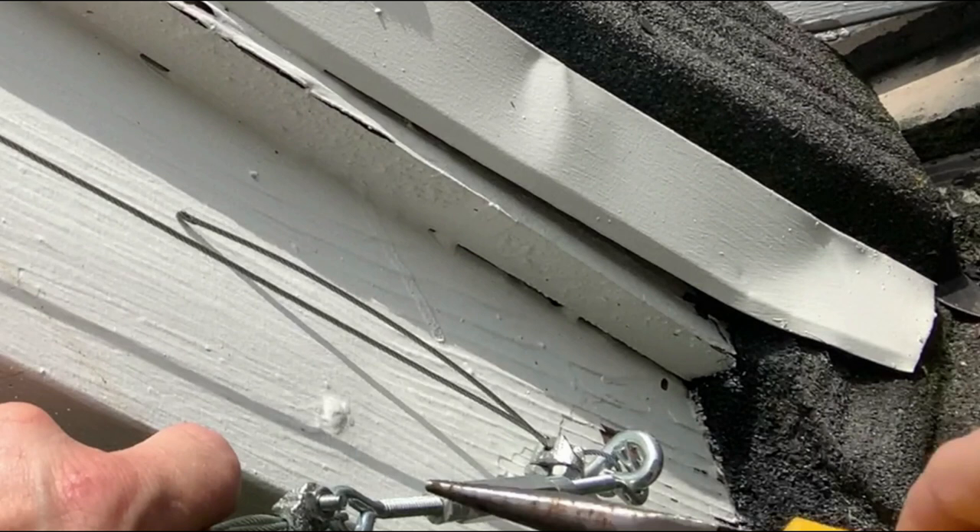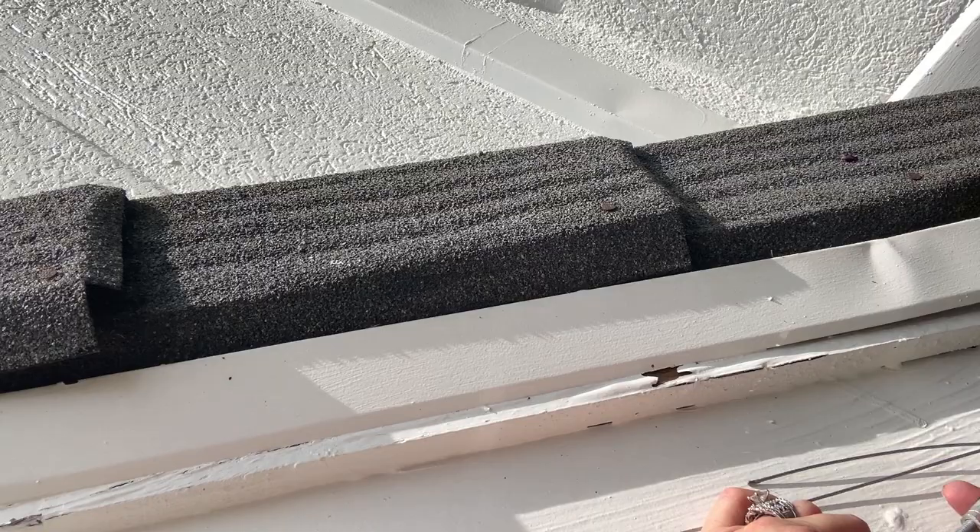The last part is you put your cable through your clamp, through the eye hook, and back through the clamp, making sure that it will fit in your eye hook as you're tightening up your bolts. It's smart to just keep pulling the line making sure that it's nice and tight. Then you just tighten up your turnbuckle and it'll take up all of the slack in your cable system, making it nice and tight.